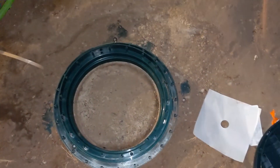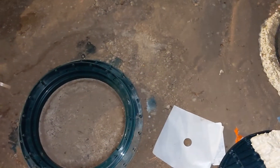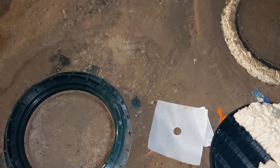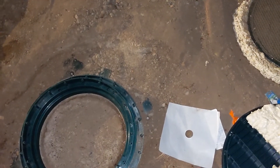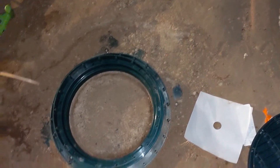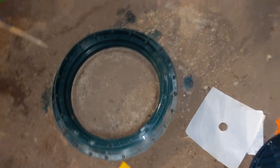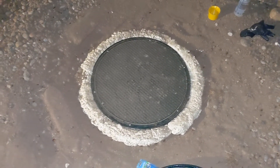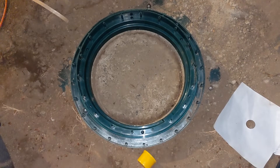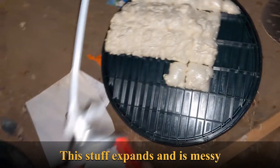The goal is to replace and augment that lost insulation. The regular dirt sitting on this is only about six or seven inches, which is pretty low — if I were redoing this whole thing I'd put insulation in from the start. To mitigate it on this Polylock riser I'm going to insulate two ways: first, fill the ring between the 20-inch and 24-inch riser ring up to the top, and second, fill the inside with foam up to this point right here.